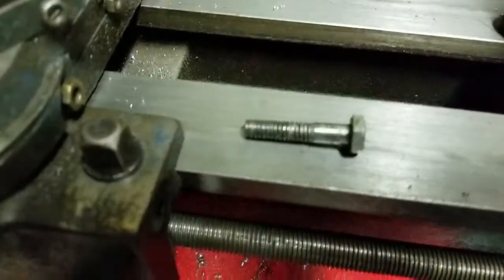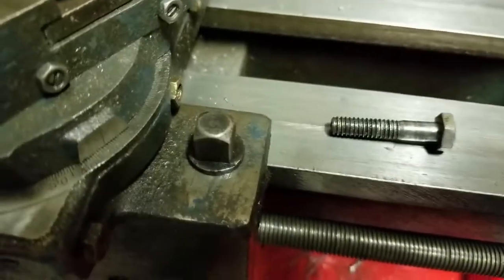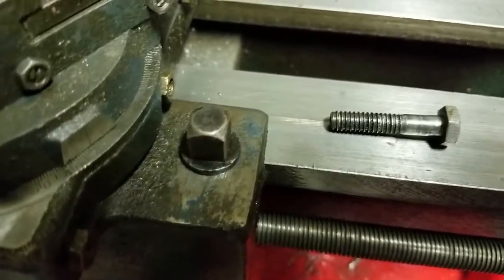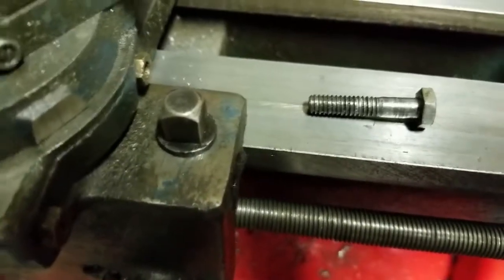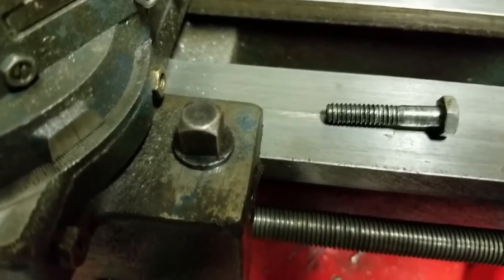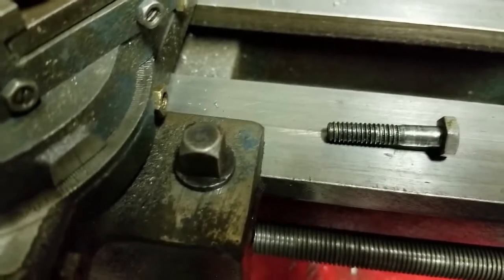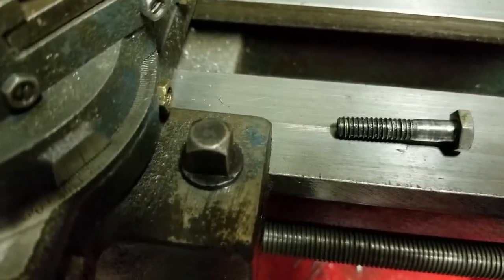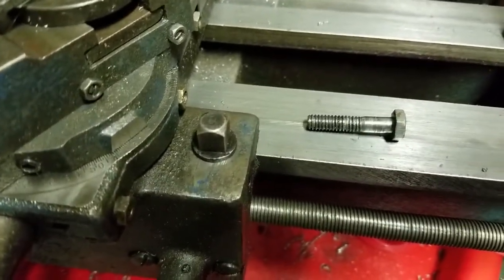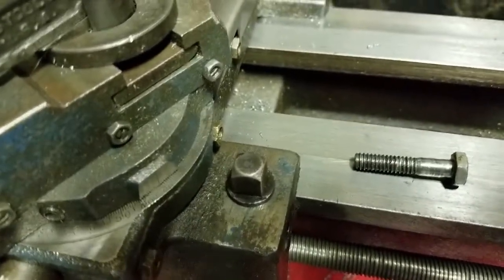Here's what was in there compared to that. Realistically, with machining this — one bolt — it took me, with getting the tools out, about 22 to 25 minutes start to finish, getting all the stuff out and together. Once your tools are out, you could do more and save time on production if you need several for a piece of equipment you're refurbishing or restoring. And then the blackening took about three minutes total. You saw how fast it heated up — I've got an oxy-propane setup, and I also have an oxy-acetylene.